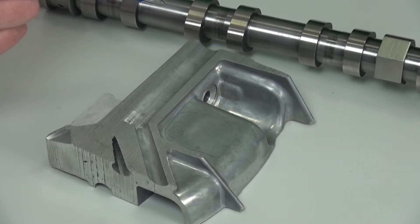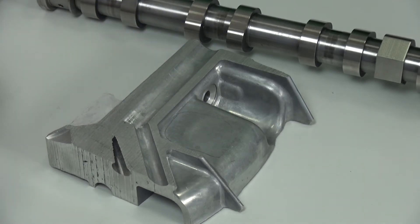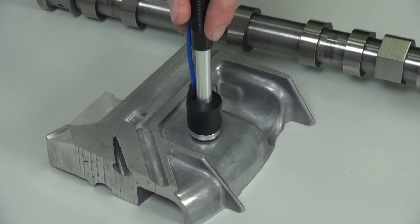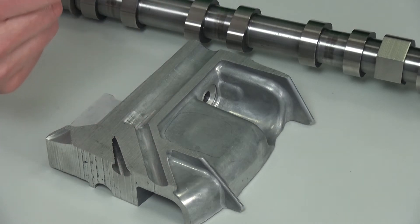For this you can use a support coupling, which is available on our homepage. The probe thickness should be at least three millimeters — beneath three millimeters can cause measurement faults. For hardened pieces, the hardened edge depth should not be less than 0.8 millimeters, as too little hardening depth can cause measurement failures. The geometry of the component also plays a role. The measurement on a smooth surface faces no problems. On curved or round pieces, such as a shaft, it is better to use concave adapters, which are available in the optional accessories for this measuring device.